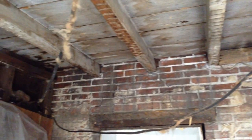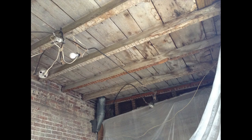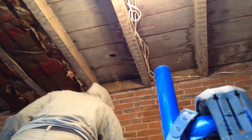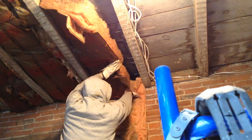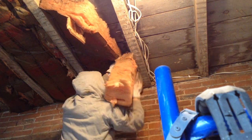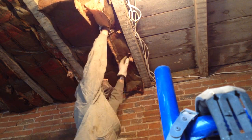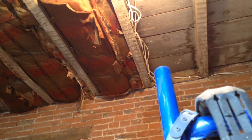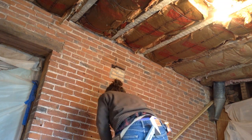At this point the exposed beam idea started to go out the window. It was still pretty cold when I was doing this and the room was just freezing without that insulation. So we decided to put up some of the older insulation that was still in good shape plus some newer insulation, and then put up beadboard. Because the joists are wider, the batts don't fit properly, so I used nails to hold everything in place and then with a little strip shoved everything up in there. Some that didn't want to stay I held temporarily with pieces of bailing wire. I hate working with fiberglass — it really affects my skin and makes me itch, and working above your head is already kind of a pain.